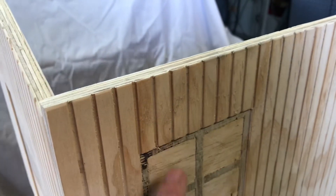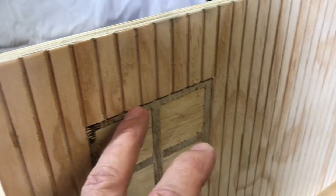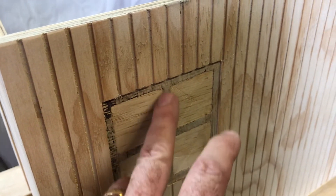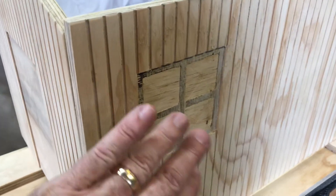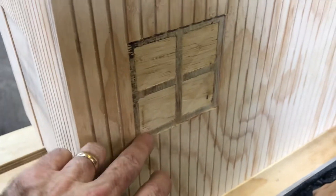Really stoked about this — Russ went above and beyond. He used an eighth inch cutter bit to cut the sides out and cut the detail, used a quarter inch bit to route out the openings for the windows, and then an eighth inch bit to give it a little more detail. He even went a little deeper where you see where the window panes would be.